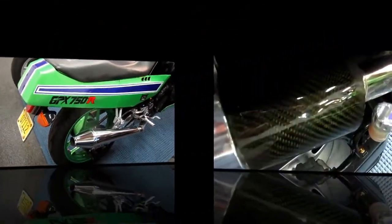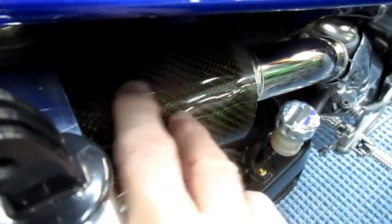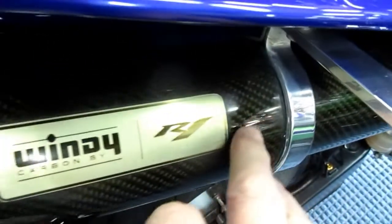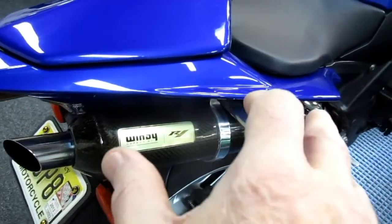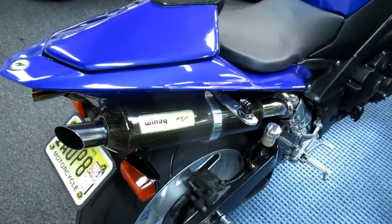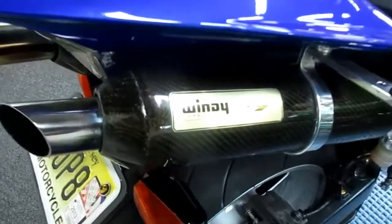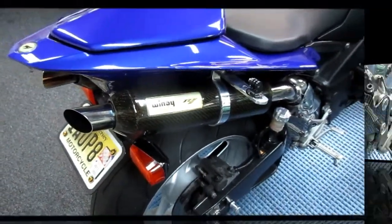Now the mufflers on the R1, when I made the mufflers, and I made a mold for these parts, I was not sure, because I had made a lot of two-cycle exhaust systems for model airplanes. I made hundreds of them, in fact, using similar material and Huntsman resin. What happened with most of those, the two-cycle ones, they had a limited lifespan. They didn't last. Now, these are going on 9 years old already, and they still look pretty decent, I guess. They have never been a problem. So I'm kind of happy the way that worked out. That was one of the good carbon fiber parts.